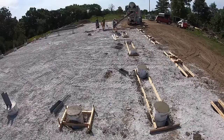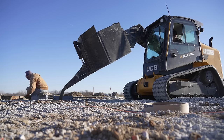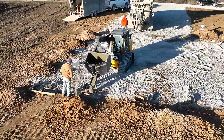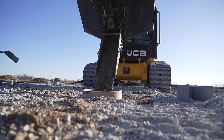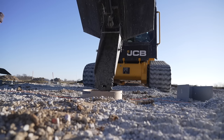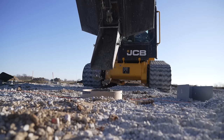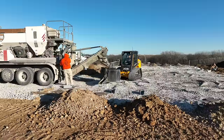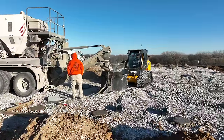A concrete bucket is a few thousand bucks — you could buy it and resell, or rent it out — probably not the best option if you're only building one building. With an 18-inch auger at 54 inches deep, we use a third of a yard of concrete per hole. The holes usually end up a little deeper since the form sits up a bit, so figure every three holes you need one yard of concrete. Take the number of piers, divide by three, and that gets you close. If you're ordering from a concrete truck, order maybe a half to a full yard extra.